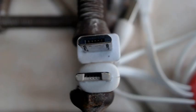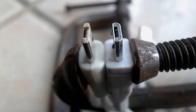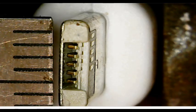As you can see, the A and the B micros are pretty close — the B just basically has the corners knocked off and is a little narrower than the A. This small difference would probably prevent you from switching them accidentally and destroying the connector on one end or the other. I've never actually seen a Micro Type A connection used on anything, but just be aware that if you're using one of the older-style ESP32s, you've got to make sure you have the correct cable — the Micro Type A cable will definitely not work.